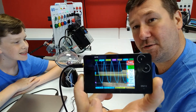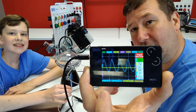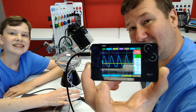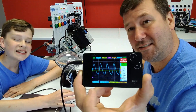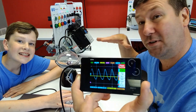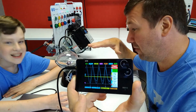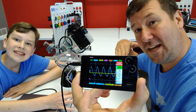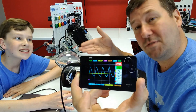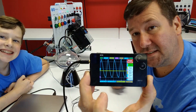What I wanted to do is take a moment to show what the bare wire does on the shielded cable. Michael, will you grab that wire? You see — just by Michael grabbing the wire it actually lowered it down. That's because he's kind of acting like the ground. In our Stem with Tim videos we've talked about how changes in magnetic fields can cause voltage to be induced on wires, and that's what's happening here.